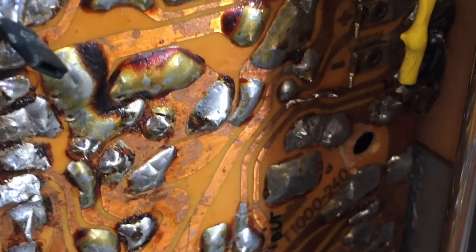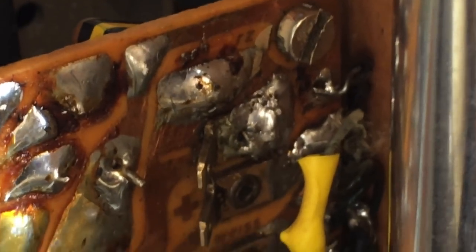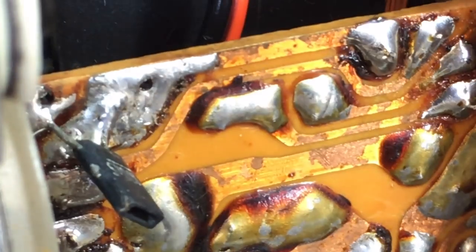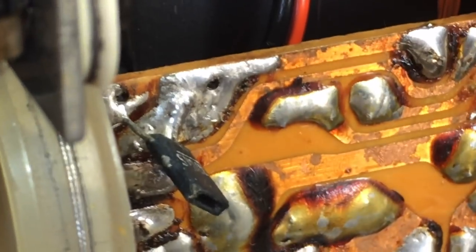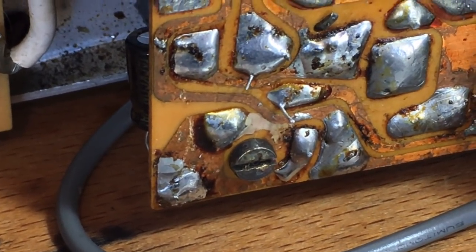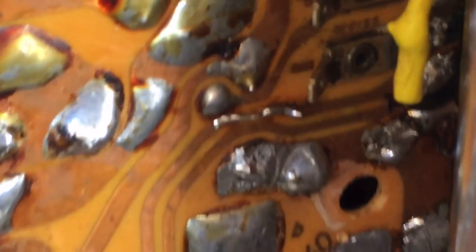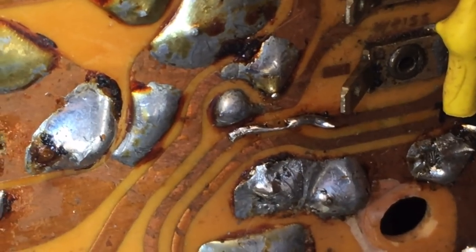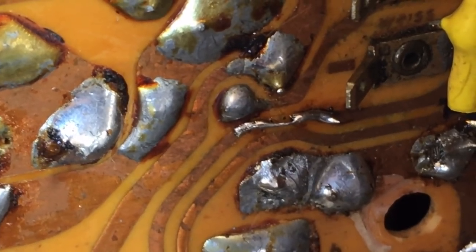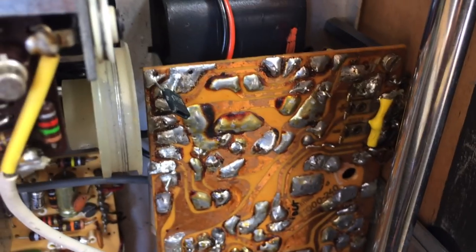There's some wiring at the back there that's been badly soldered. In fact, it doesn't look like it's been soldered at all there. I'm not too worried about the flux, that's normal. But certainly someone's worked on this board. And I believe, look at that. Seems to be some strange solder blobs everywhere. Saw another one here. That could be simply to correct a broken track, but it's iffy. Looks like that definitely will have to be looked at carefully. So that's been messed on.